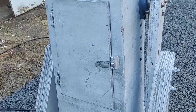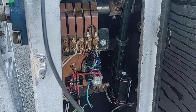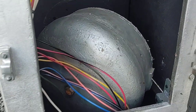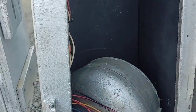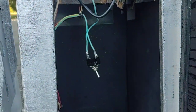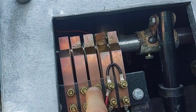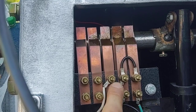Probably what everyone really wants to see is the inside of the gate mechanism. Just open these latches. Honestly, I don't think it's really impressive — what's more impressive is the bell down there. That is a WRRS mechanical bell, which I had to take some parts off of to get it to fit, but it's a real bell. There's a switch right here that is to drop the gate for maintenance reasons. This set of contacts here is for the flashing lights.